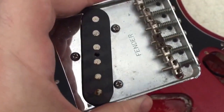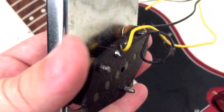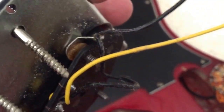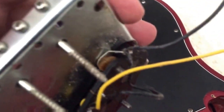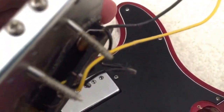Here's a close-up of the standard Fender bridge. Now these Tele pickups usually have a metal plate under them which is grounded, but this one does not. What they did was this cool thing — you can see they put a little grounding strap from the ground side of the tip of the pickup to the bridge, with that little loop right there. I might try to replicate that on the next pickup — neat idea.